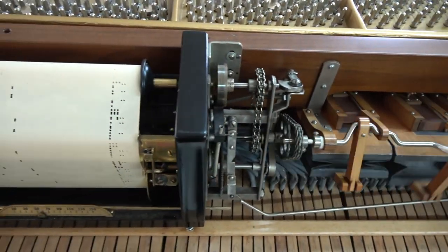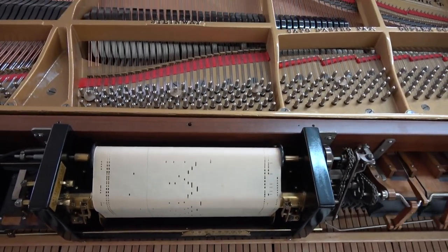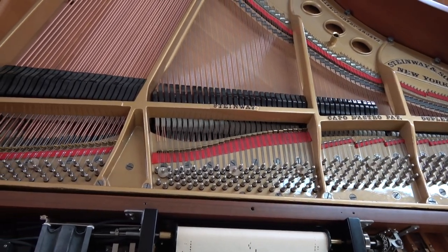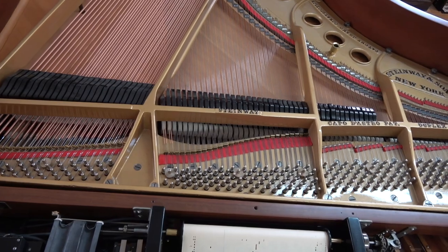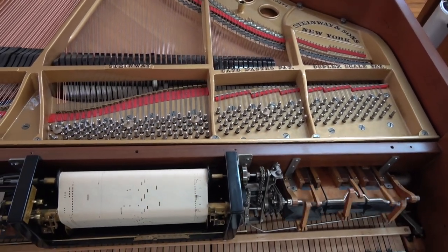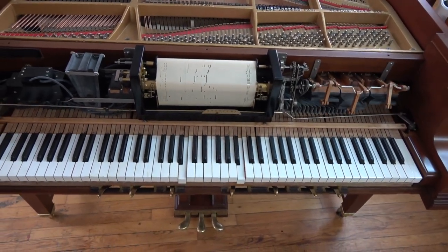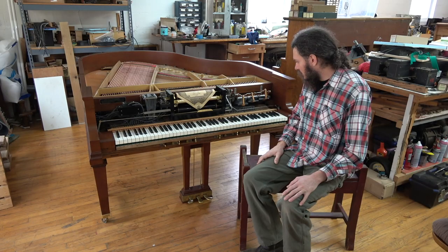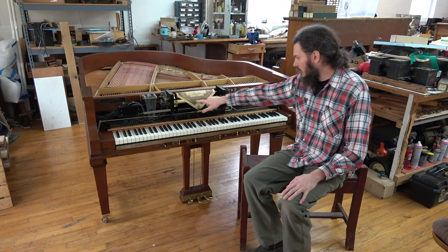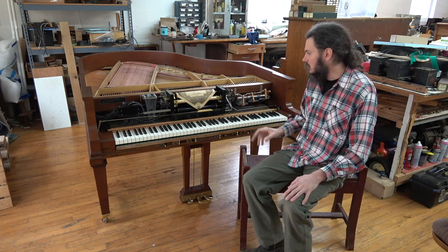But basically, we take everything apart. For example, from what you can see here, this is the air motor, and everything needs to be taken apart and cleaned. You have to put new graphite on the sliders. You have to recover all the bellows with new pneumatic cloth. You have to put new pipe tubing all around. The spool frame is the one that doesn't need much work. Usually you just clean it up, spray it, refinish it, clean all the brass, and then retube it, where you replace all the old rubber tubes that go from these holes all the way down to the player stack. They activate the actual striking pneumatics.